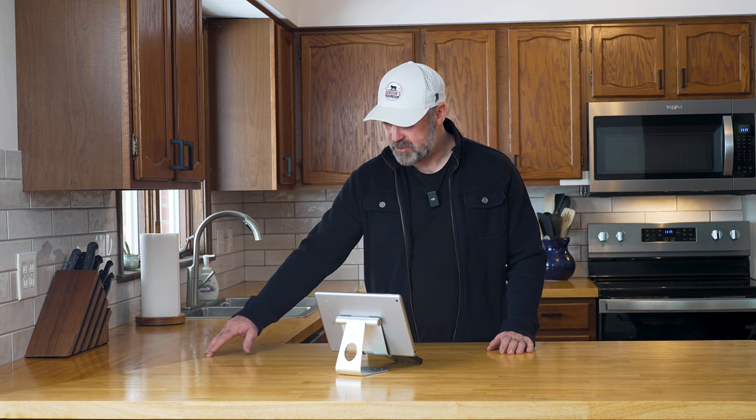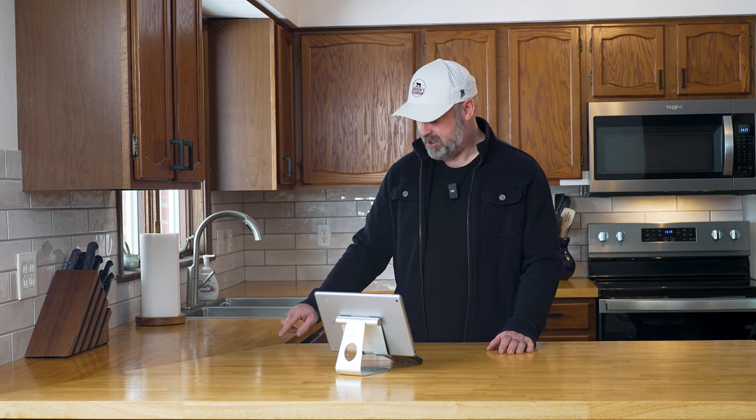You'll notice you can kind of see the seam a little bit — that's my mistake after sealing. I didn't do a good enough job of cleaning out the sawdust between the cracks. When you don't do that, the sawdust can turn dark when you put a stain or sealant on it. So make sure you clean your seams out really well. I'll take care of that when I do another sanding, maybe after year four when I give it a refinish.